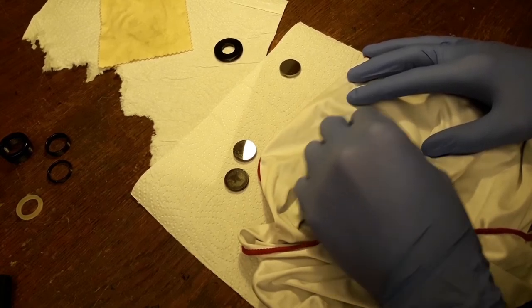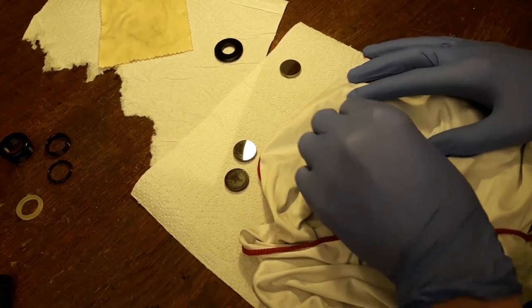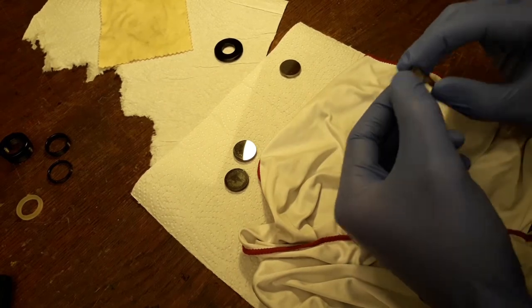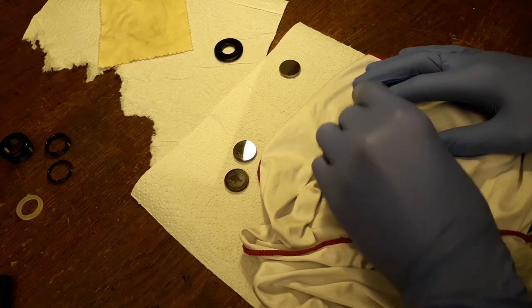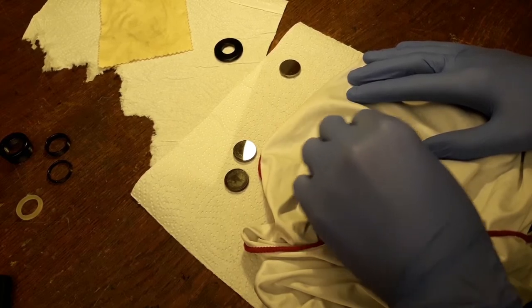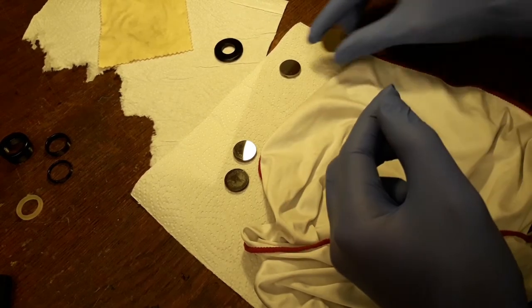CO2 laser mirrors have to be near perfect. Otherwise, you're just gonna lose tons of power on these mirrors. And of course, if that happens, you lose power at the laser head. And another problem is that these mirrors, when they absorb too much of the laser beam, are gonna heat up. And that's not good. Yeah, I think that's satisfactory.